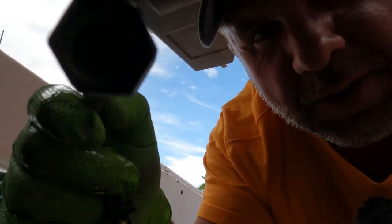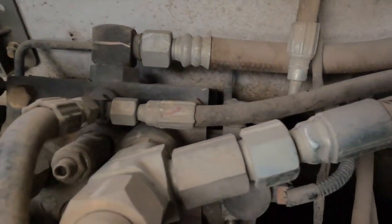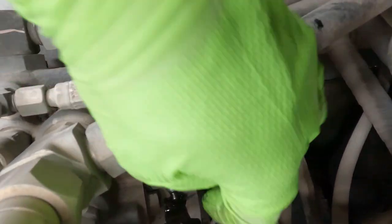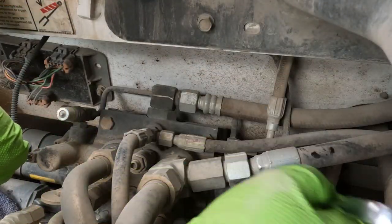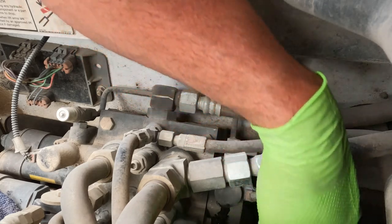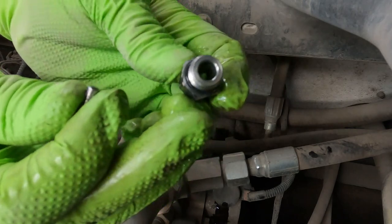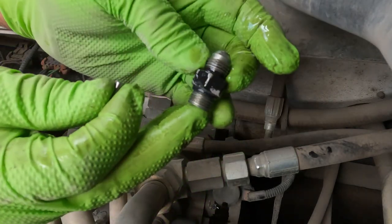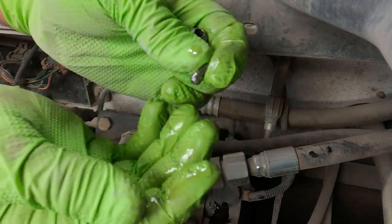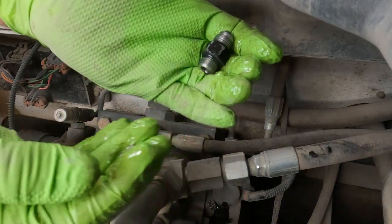It's important that we find that spring. Where did it go? Ninety percent of the time it's stuck down inside the tube line — you're not going to be able to see it. I'll get a pick and pull that spring out of the tube line. Here's our fitting and here's the poppet — it comes out the backside. Other than that, it's just a hollow tube, a standard JIC fitting. This check is a backup: if you were to lose charge pressure, it would actually hold charge pressure in the BICS side of the valve so your controls wouldn't completely lock up.